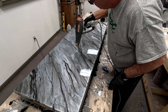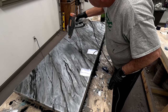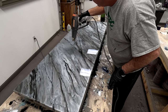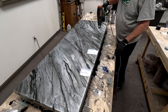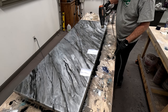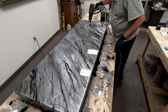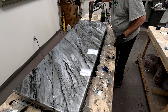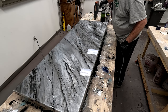All I'm doing now is using my heat gun — like Mike used to call it, painting with air — and just moving those veins around until I like them. Once you've used the heat gun on veins, you'll get a better idea of what it takes to open and close them. Stay up a little bit higher and you can open them up. If you heat on each side of the vein, that will allow it to open up a little more, because you're making the epoxy more fluid. Now I'm just putting the final touches on, getting the veins where I like them. Then I'm going to let it set for 24 hours and come back and sand it and apply the UTC.